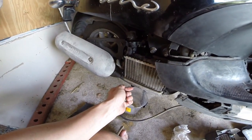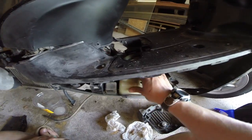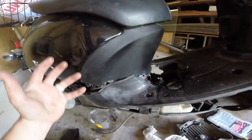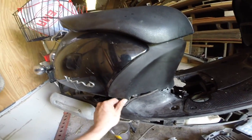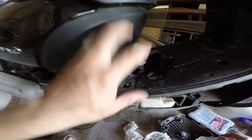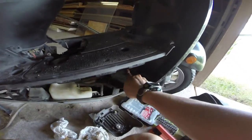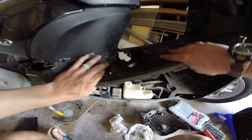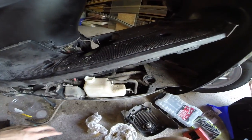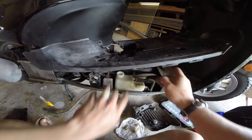Alright, update status. I've been draining this quite a bit. I'm just putting the drain plug in barely, filling it up, and it's coming out lighter and lighter every time. The coolant reservoir is so dirty that I'm going to take it out and clean it now. But this whole thing was locked down like Fort Knox — it took me a good hour to get apart. And this scooter is missing half the screws anyways. It's like you have to take this off to take this off to take this off, then take these little side things off — one on both sides — then this floorboard was clipped in up here. I was afraid I was going to snap it. I had to pull the battery out. There are two screws holding this in. I'm going to take those out and just wash this in the sink.